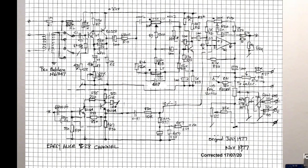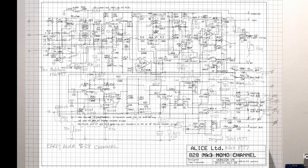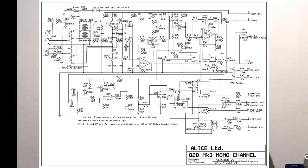My old mic amp developed for the 828 Mark I works differently. The amplifier relies on feedback to produce distortion-free sound, but it operates in Class A, meaning that it has an extended overload margin and zero recovery time. The transformer provides further protection against transients, making it virtually bomb-proof. Consequently, the old Mark I sounds good under a variety of conditions. So what does all this tell us?